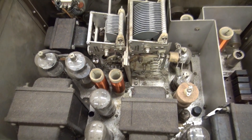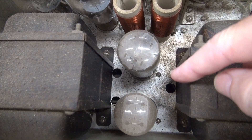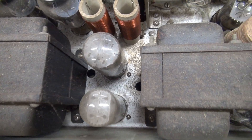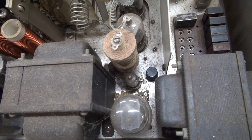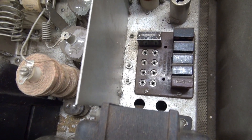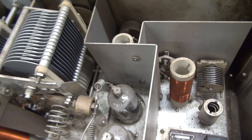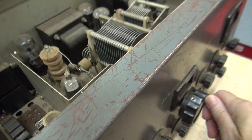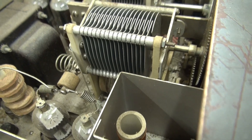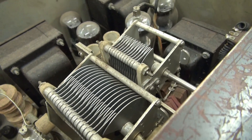These are all factory built, so you won't see the red stamp between the 5R4 rectifier tubes — maybe somewhere else on the chassis they've identified that. The crystal bank has a few crystals installed; I pulled one and it was on 80 meters. Everything in here looks good, it just needs a serious cleanup. The roller inductor is free to spin and that's a good sign — it's not binding. The controls feel nice and tight.